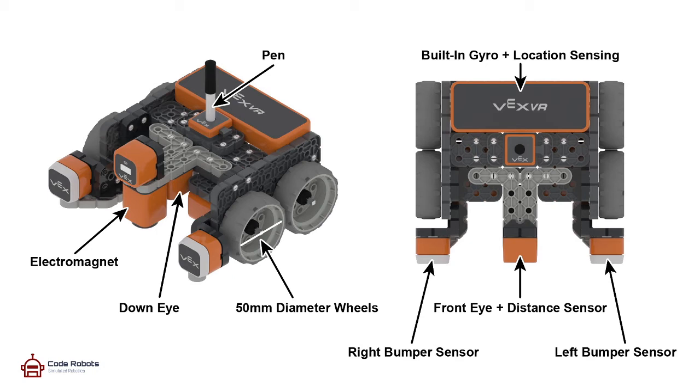That's a little bit complicated — we'll come more into that later. The front-facing eye sensor, which you can see better in the right-hand picture, also acts like a distance sensor and returns the distance of a detected object in either millimetres or inches, depending on what you ask it for. The gyro sensor is built into the drivetrain, and clockwise is positive — that's pretty standard, just like going around a compass: 0 to 90 is a right-hand turn, so moving to the right is positive.